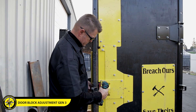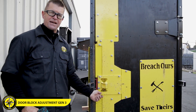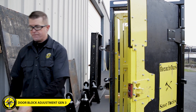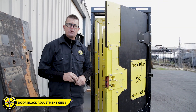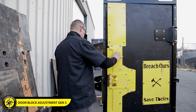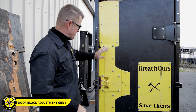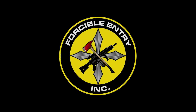Notice here: the backside of the carriage bolt isn't grabbing, which is fine. Once we have one of them holding, we can pull the pins back out and open the door — in this case our security screen door is in the way. Hold the carriage bolts in place. After ensuring all your bolts are tight, do one last check to make sure your pin block is lined up straight. Dowels should feed in relatively easily; sometimes put a little pressure on the bottom or top of the door to help the pin block line up. Make sure they move in as freely as possible, and once you've done that, you're ready to breach your door.